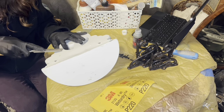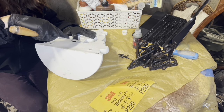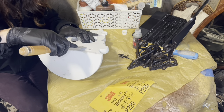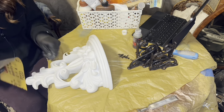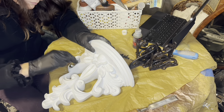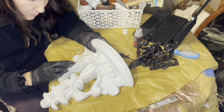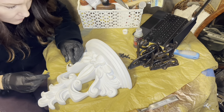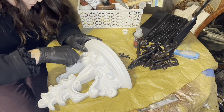And I'm just using that glue to kind of fill in any chips and get those things nice and ready to go for paint. The back of this corbel had a few drip marks, which was kind of weird because the whole thing was white — it was a very interesting piece. So I just used a chisel to get those off and then sanded what I could. I have a teeny tiny piece of sandpaper there, just smoothing out where I had that glue and making sure it's shaped like the one on the opposite side.